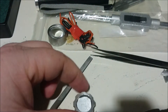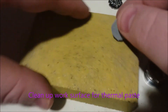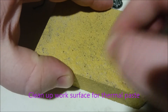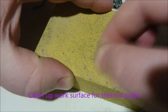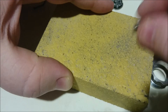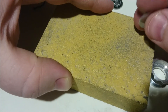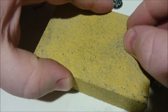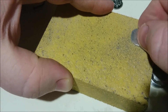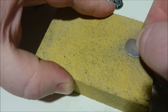I think we can pretty much push that in now. Now for the heatsink — I'm just going to roughen up the surface but keep it smooth. This is like 320 grit. I just want to sand it down. It's got a little coating on it and you want to get that coating off — you can remove it just by using alcohol or mineral turps or something, but it is also good just to sand it down.